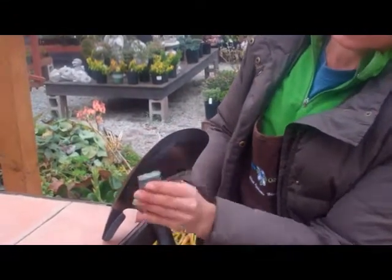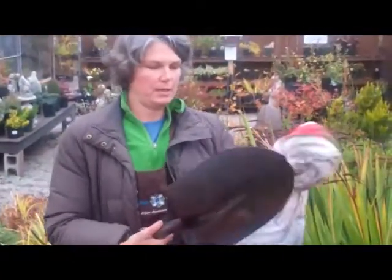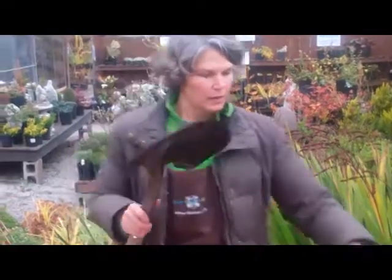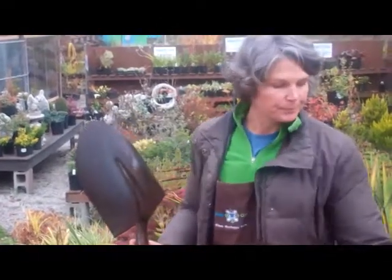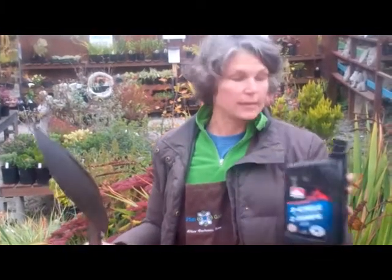You just sharpen the edge up, take off any little knurls, things like that. Dry everything up when all the rust is off. You can spray it with a rust inhibitor. You could also put some motor oil on it — that'll seal it up.